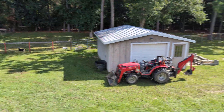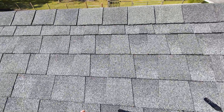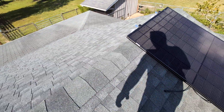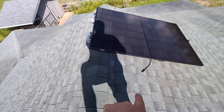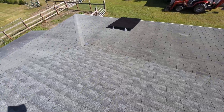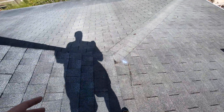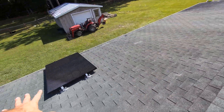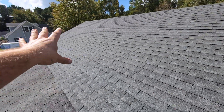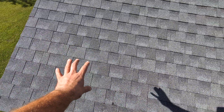We just had four baby goats — pretty common here, it's just how we roll. On the upper roof line, I snapped the chalk line yesterday at 21 inches from the top. There is a fire code requirement within NEC to have 18 inches from the top of the panel to the ridge, so I gave a little bit more. That leaves a walkway between the two double sets that run 10 panels each — so this will be 20 panels total — and I'll put my junction box on the roof to accommodate all four strings.